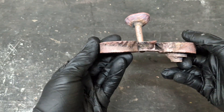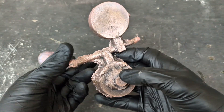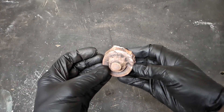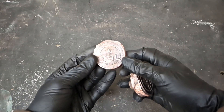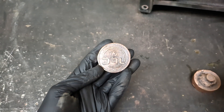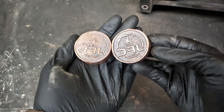That's actually a lot of work that I did not anticipate, but I kind of did when I made the mold — because any empty cavity is going to be filled with copper. When I removed those aluminum patterns I already knew ahead of time that it was a lot of work. I won't waste your time showing you all of the process. I did start sanding it down but then I went to a coarse file, which really worked well for removing that flashing. Then I finalized it by running it along my sander and I think they came out pretty good. I didn't go crazy on the perimeter because the perimeter doesn't really matter — it's not for show, it's just for stamping. The face of it looks excellent on both of these.